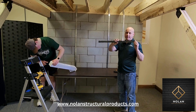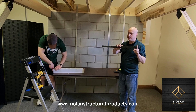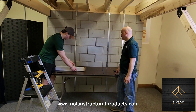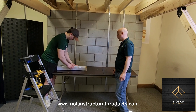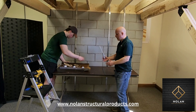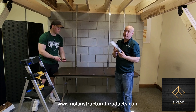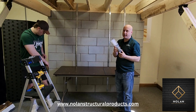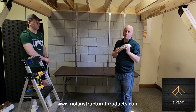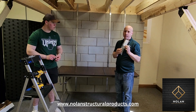You will need at least 9 inches to each side of the notch before the screws go into the bottom of the joist. The kit includes all the screws you need — there are 32 of them, 16 on each side — because we need to get the full strength of the joist. It also comes with a drill bit for pre-drilling the holes, which is very important, and it also comes with the nut driver and instructions.